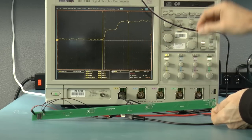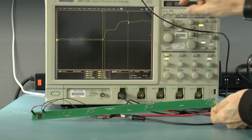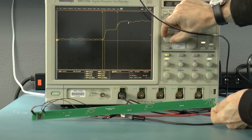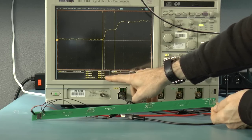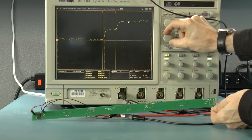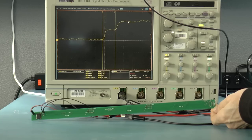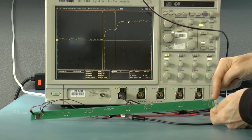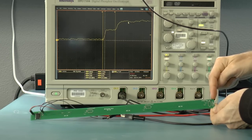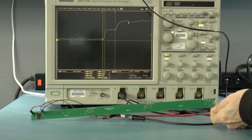Now we can make some measurements. If I take a look at the start of where I launch the signal, and then move this other cursor to the start of where it sees the reflected doubling signal, I'm getting about 6.4, maybe 6.6 nanoseconds. It looks like it's about 6.6 nanoseconds. So what that means is: starting from no signal, the signal begins at zero, travels all the way to the end for 3.3 nanoseconds, gets reflected, and then spends another 3.3 nanoseconds coming back — at which point the voltage starts to double. So that's 6.6 nanoseconds. Now that's not the 8 nanoseconds I thought it would be, and that's okay.